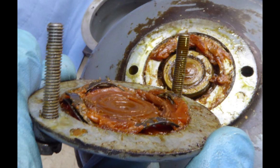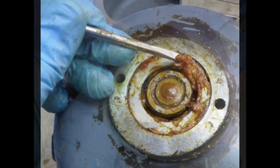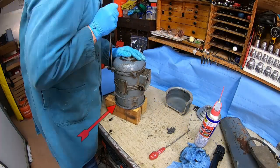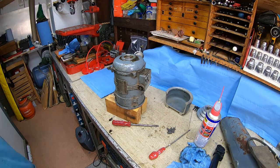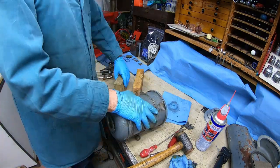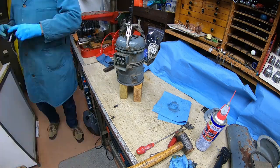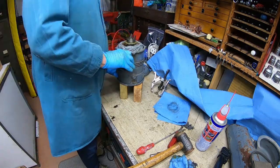Inside the cover there are two wave washers, one on top of the other. These washers apply a preload to the outside race of the bearing and keep the bearing and rotor in the correct position. Once the old grease is cleared, a shim can be removed — it normally sits between the outer race of the bearing and the two wave washers. There is a housing at the front of the motor and another at the rear, each attached to the motor stator by four screws each — I remove all eight screws. The rear motor housing has three tabs around its outside edge, which enable a three-legged extractor to be used. I warm the cover with a heat gun and it slips off the bearing easily with just finger pressure on the extractor's centre bolt.